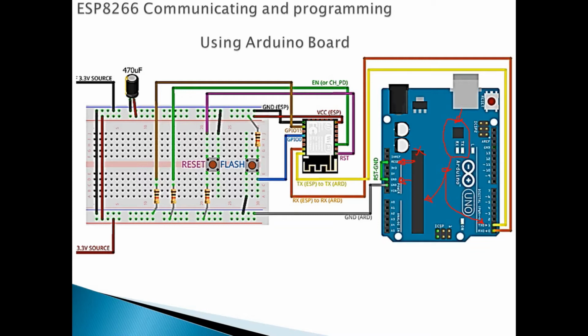But for sure the better method is to just keep resetting the MCU by connecting the reset to the ground. So the RX and TX output will not be interrupted by the function of the MCU. So the USB that comes from the computer will always go through the converter and come to the RX, TX, and go to the ESP8266 directly without any interruption.